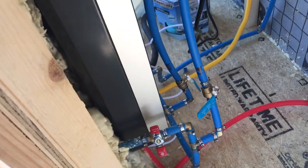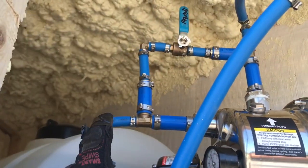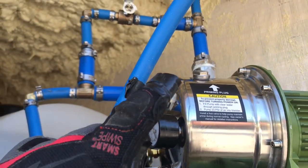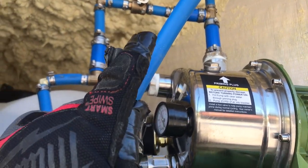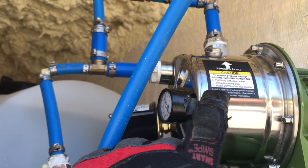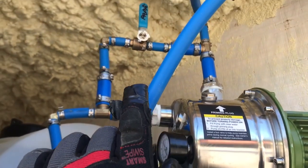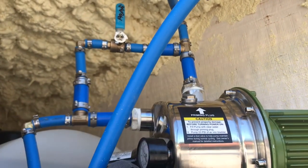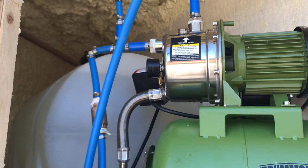What we do is fix it up so you can bypass the front of the pump and go right in at the top to fill the chamber, saving you from having to undo the cap and prime it manually. In some applications where it's almost level with the unit you may still have to add a little water. But most often if you're below the water level and you turn the valve, water will flow into it appropriately and you won't have much trouble priming it. That's pretty much it in a nutshell.